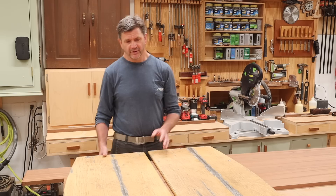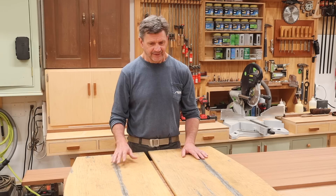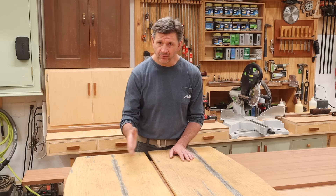That was a bad idea because lacquer is not a good choice for an outdoor project. This wood is hickory — this is the first and only time I've ever used hickory so I don't have a lot of experience with it. I'm not sure if it's good for outdoor projects or not, but the lacquer is definitely not a good choice. When it comes to outdoor finishes you really have to follow all the steps to get a good strong finish that will last outside.